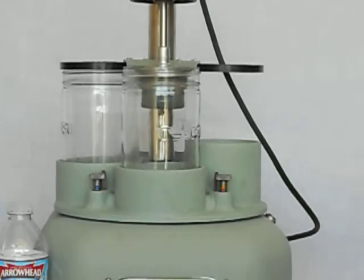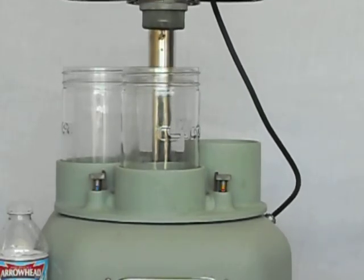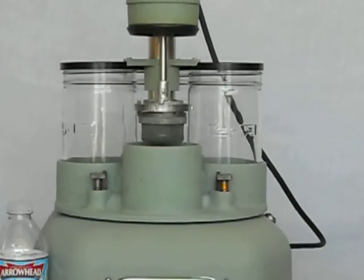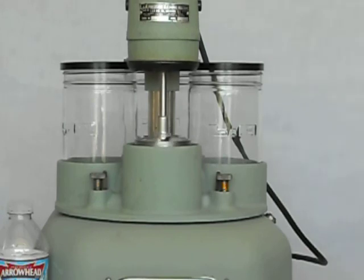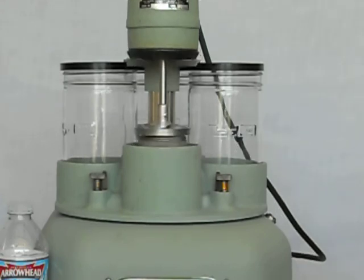parts after they've been rinsed twice to give you completely dry watch parts once it finishes its completing cycle. Again, it's all automatic. Once you set it and start it, it goes through the whole station cycle and cleans your watch. So the basket will rotate, and hot air is being blown up through this cylinder onto the watch parts to thoroughly dry them, so that no residue or liquid material is left on the watch parts once that heating is done.